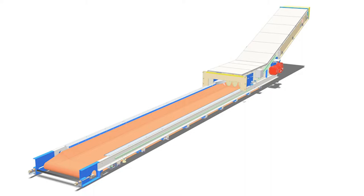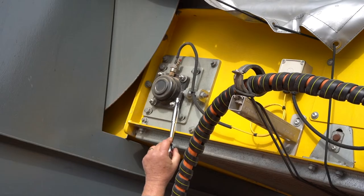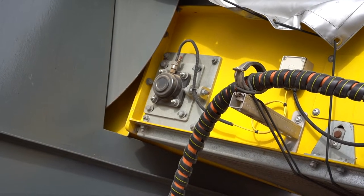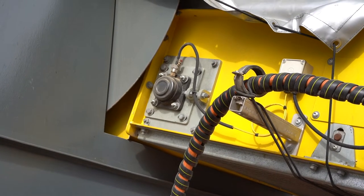Now this is essentially like a steering wheel. If you move the bearing block back towards the tail on one side — if you move it back towards the tail on the left side of the conveyor — it will drive the belt towards the left of the head pulley, and obviously the other way, if you move it forward, it heads to the right side. We measure from the square frame edge to the back of the bearing mount and we adjust on both sides so that the distance on both sides is the same, then we know for sure that the head is square.